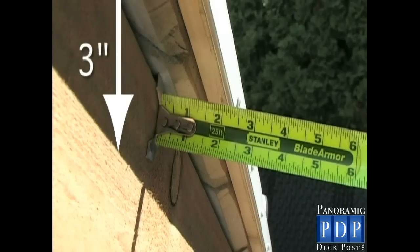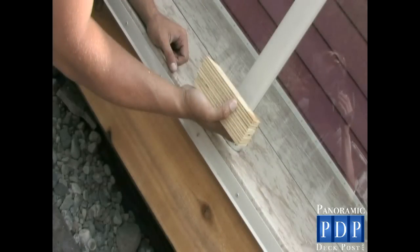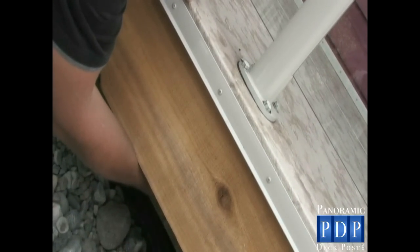This includes your deck's surface. In our case, our deck's beam measures 2.25 inches from the deck edge. Helpful Hint Number 1: if your post position does not allow for at least 3 inches of bite, cut up some quarter-inch plywood into 4x6 pieces and place them under your deck in the post's location. This will allow the lag bolt to suck the piece of plywood up against the underside of your deck, providing a secure and sturdy post.